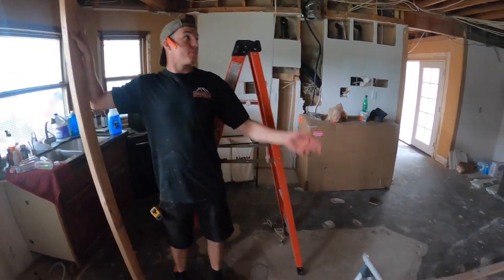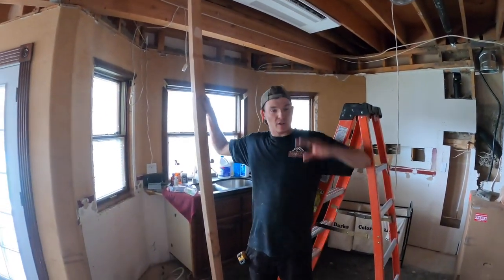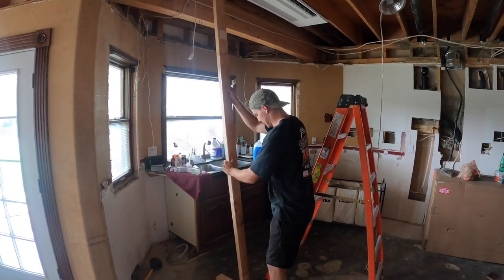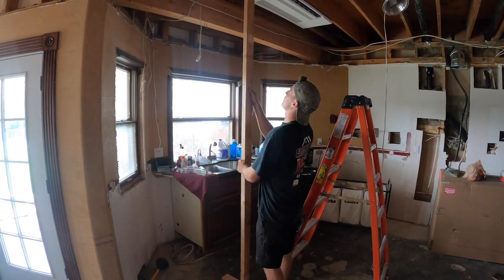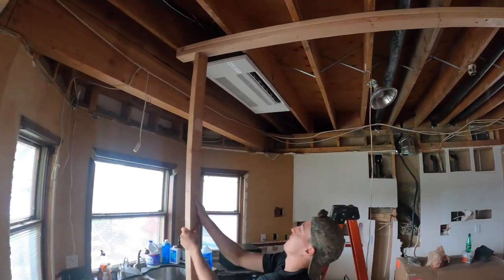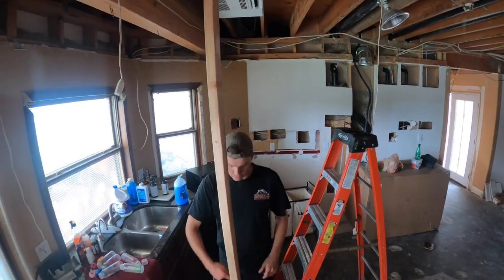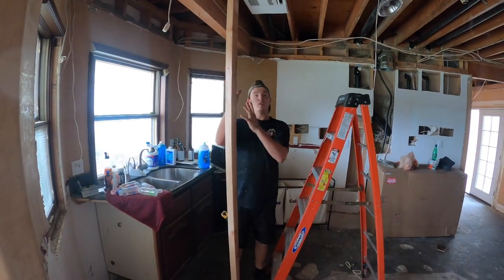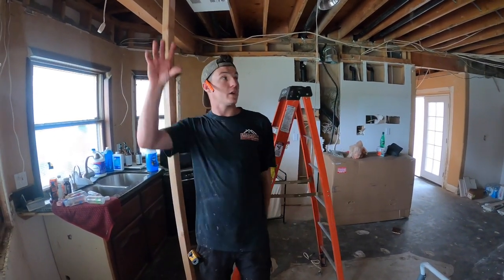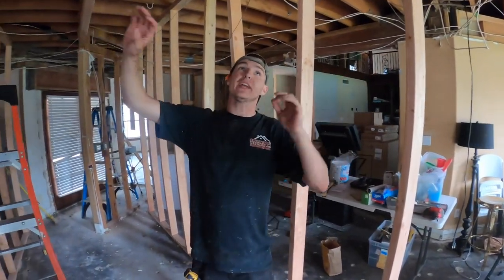We've got our base plate down and Nate's got our two top plates up, screwed up there. Now this is important — you don't have to measure in between and cut it perfectly. We add a quarter inch, for example. Watch how much weight it takes on — you can hear it and feel it, but now it's supporting. This is a supporting member. We'll hammer it in place; it's okay if it's a little cockeyed — we'll screw it so it doesn't slip or fall out. We're going to do that every couple feet, probably have 20 supporting members, and from there we can remove our beam because the second story floor is now supported.